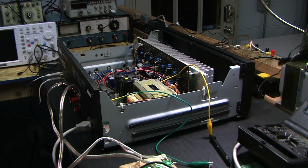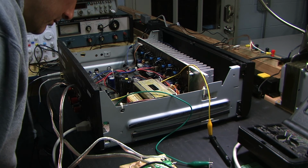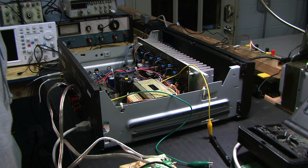So what I'll do tomorrow night is start testing some voltages at the speaker, making sure there's no DC on the output, and I'll pull out the schematic and we'll look at the circuit and measure a few things. Mostly power supply voltages, and make sure everything's in order, and then give it a listen. I just want to see how noisy those caps are to see if I need to replace them, but I don't know. Wish I knew how old they were. There's no way of knowing. Tell you what, they'd be a pain in the ass to replace. They glued them down. Alright, enough's enough for tonight.